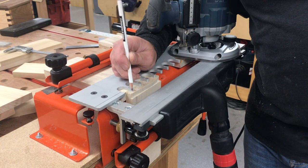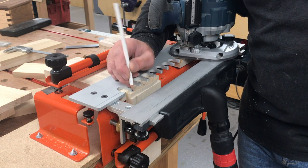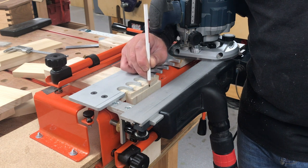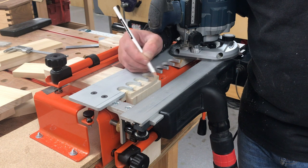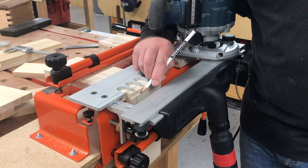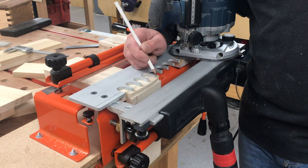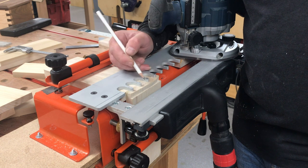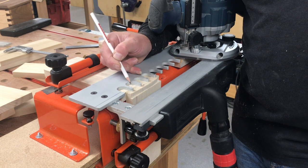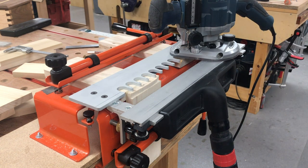Right, just wait for that extractor to stop for a moment, just to clear the pipes. Almost there. So all the way along here, this looks really untidy, really wavy, don't worry, that's not the key. The key is this crisp, clean corner all the way along. There's no potential for breakout now. We've already removed the material, there's nothing to break out. So scribe cut, from right through to left, that way. And then we're going to start here. We're going to come in, go out, go in, go out, and back again. Okay, let's do that. Eyes and ears back on.